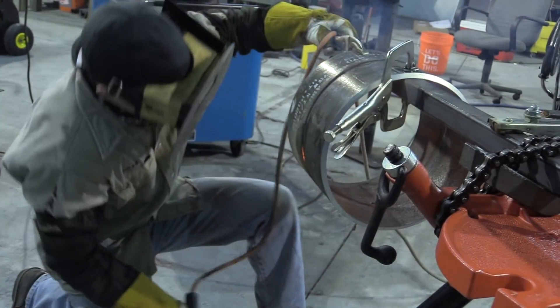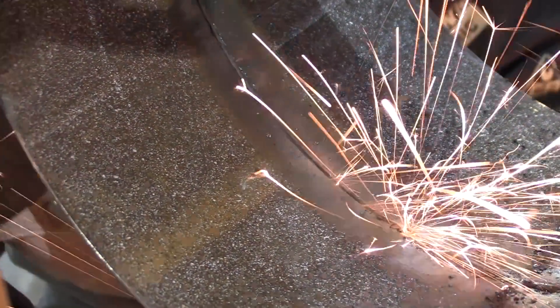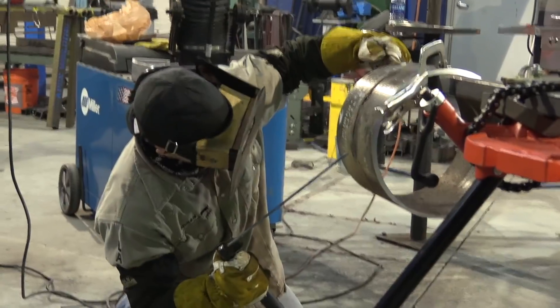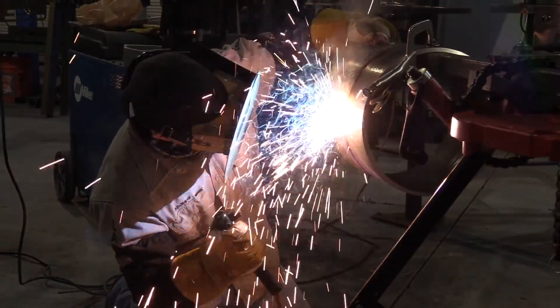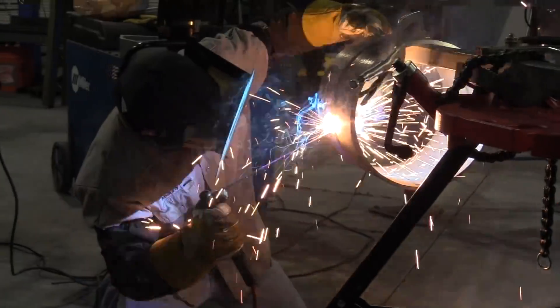All tacks are feathered. Coming up on a feathered tack, you'll see the arc get a lot brighter right there — that's because the arc is no longer going on the inside of the pipe. Andrew forgot his pipe wedge, so he's having to open up the gap a little bit with a slitting wheel. Then we go again — lighten up on the tack, warming that tack up nice before getting to the end where he can plunge through.